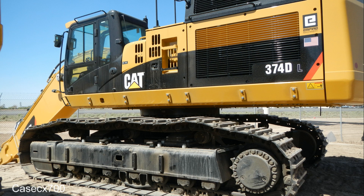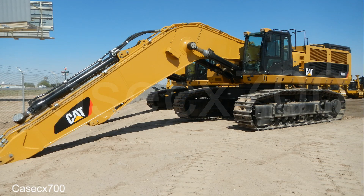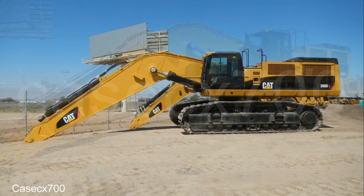It is also the scraper engine in the CAT 657 — the tractor engine in the 657 is the C18. This engine gives a displacement of 928 cubic inches, and the total operating weight of this machine is 156,819 pounds in a standard configuration. The standard track width is 36 inches, along with 26 and 30 inch options, and there are 47 track shoes per side. The swing speed is 6.4 RPM, and the maximum travel speed is 2.6 miles per hour.